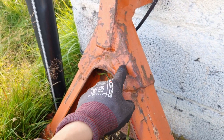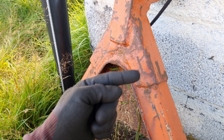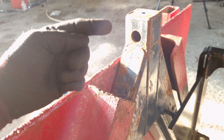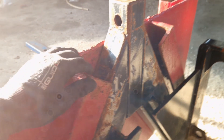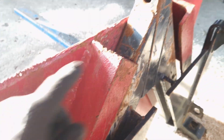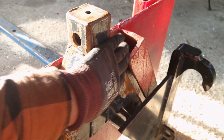You'll need multiple of these on each piece of equipment, but you just need the one tractor part. That's what it's designed for — you get those equipment parts that are just weld-on, without the three-point stuff on them, and then you put this triangle inside of it. But as you can see, I've just made my own kind of adapter — brackets rather — that this triangle fits inside, because these forks are homemade.